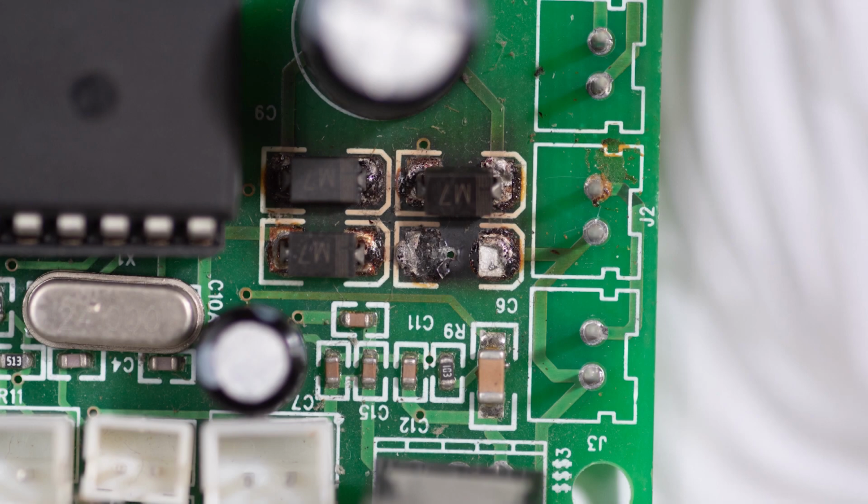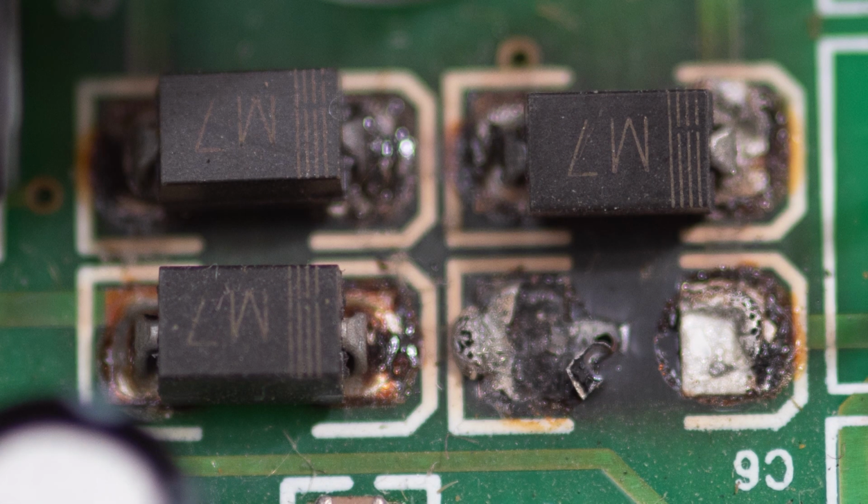Right, okay, so here is a picture of the 4 diodes. As you can see, they're in standard bridge rectifier configuration, but they're a little unwell and they're suffering from heat stroke. And we'll go to a close-up of the pad of one that fell off the board while cleaning off that horrible glue. As you can see, the solder's not very even and has overheated to the point of oxidising. That hole in the centre is actually a via to the AC input of the board. The heat caused by the overloading of the diodes has blackened the PCB right through. I won't know the full damage until I remove those components and actually clean the board.